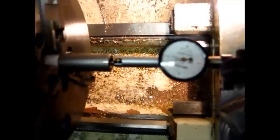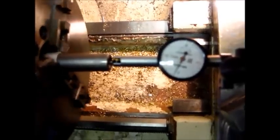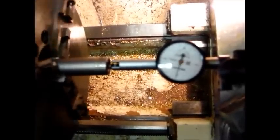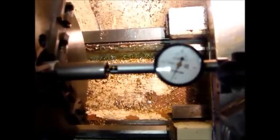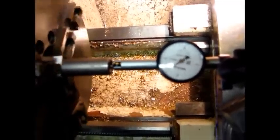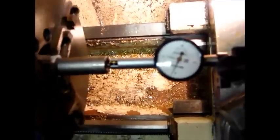Internally, the barrel is pretty close - you'll see it snaps back to zero between the lands every time, except for one spot. This barrel isn't machined very well; there are a lot of machining marks in it. I was pretty upset with the way the lands looked in the chamber - they were uneven too. It looks like when they put the cutter in, two of the lands start immediately and the other two lands start after maybe 10-20 thousandths of an inch. There's no way the bullet can possibly start straight in this barrel. I'm really disappointed in Browning's barrel.